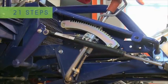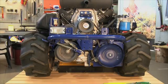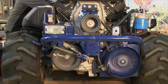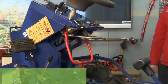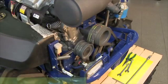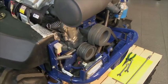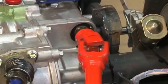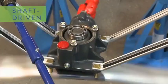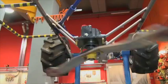The shaft drive to the mower deck is an extremely robust piece of engineering. The deck is activated by a large lever that is directly in front of the operator's seat, just below the steering column. When the lever is actuated, the twin cylinder Subaru engine powers the shaft. Very direct and efficient, very low impact on the drivetrain, simple and easily serviced and maintained. All the engineering in the shaft system is extremely heavy duty, with large diameter shafts with solid splines, helical gears, and large bearings with multiple seals used throughout.